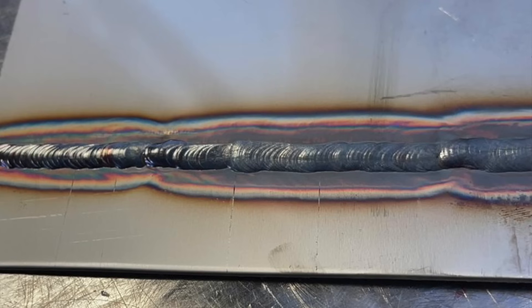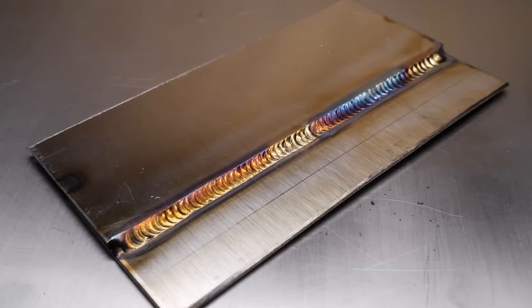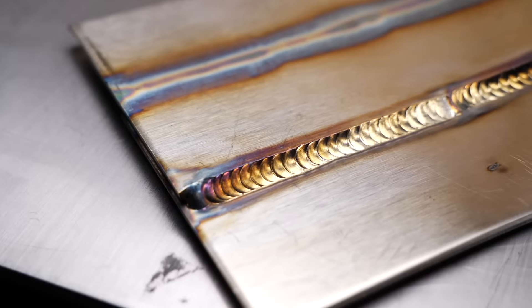The subject of amperage is obviously one of the major settings we need to figure out right off the top. That episode is going to explain why this setting is so important and give you tips on how to get it set up properly for the machine and material you are using. The next setting covered is post flow — a complete breakdown of how this setting works with your machine. I'll give you a great understanding of the overall importance of this setting as well as how to set it up for yourself. For example, when most people start to learn how to TIG weld, a lot of their stuff just looks like this. That's extremely common. What we're going to do is figure out the exact things that are going to help get you results more like this here — this is what we want. The other thing of great importance is going to be the subject of your gas volume.